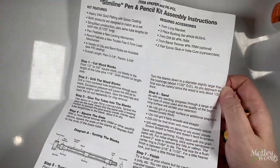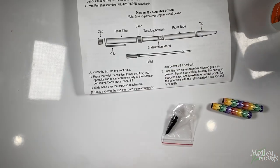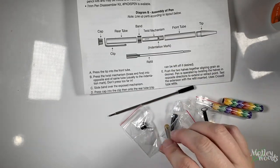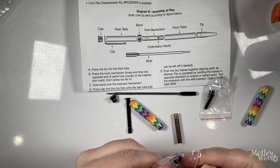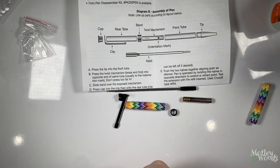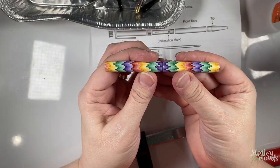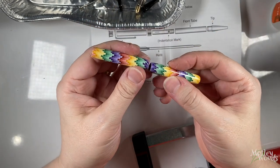Be careful if you're using something like Renaissance Wax or other wax finishes on the pen barrel — they feel nice, but since pens are meant to be handled frequently, they will rub off pretty quickly. And here you go: a completely hand-finished, no-power-tools-involved, glass-like professional finish on a pen. Next, we're going to actually assemble the pen kit. Every different type of pen kit is assembled differently — always familiarize yourself with a new type of kit and take your time. I like to start by laying out my pieces and making sure I have everything identified and in order. A slimline kit has two barrels, so decide if you want them facing the same direction or mirrored, and if mirrored, which side you want in the middle.